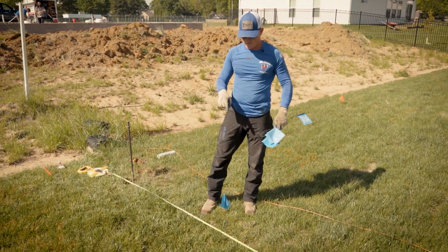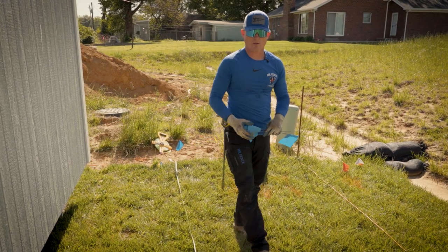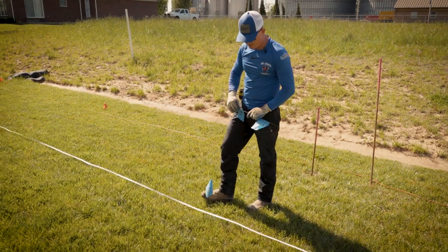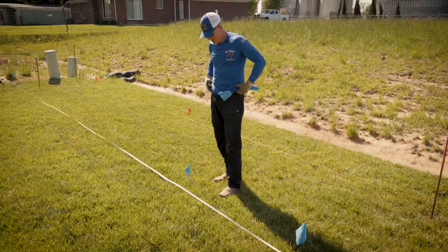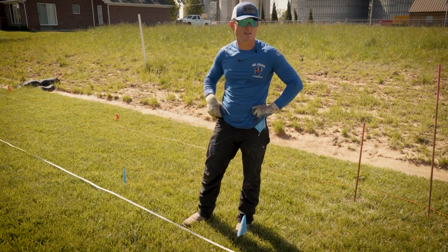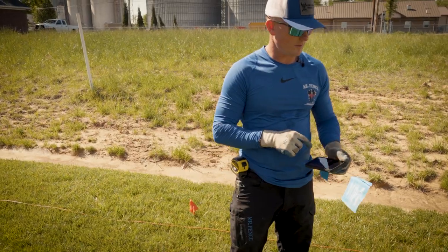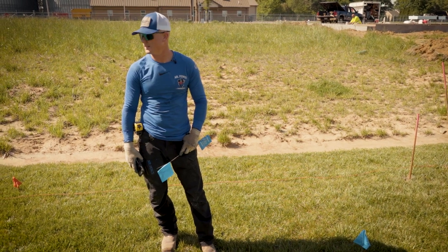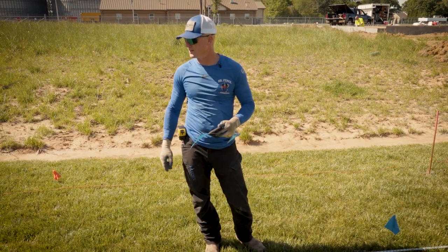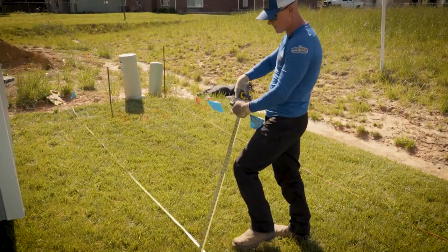From this corner to the next corner we have to put a gate in the back line. We have 61.5 feet — that's a horrible number. I think we'll put cut sections behind this barn and keep the visible sections at six foot. The gate would start here at four foot, giving us 34 foot 6 — still not great. I propose a five-foot gate, which saves a section of fence. At 27 feet the remaining run isn't divisible by six, so I'd propose running full sections for everything visible and splitting the last three sections down behind the barn.